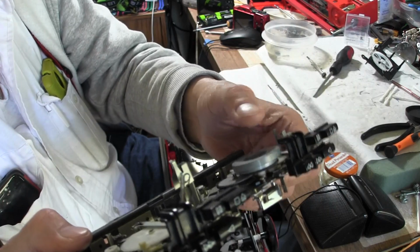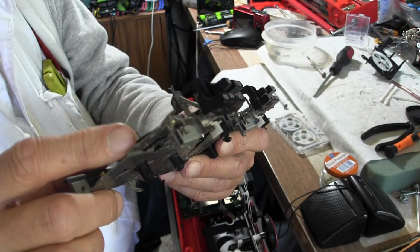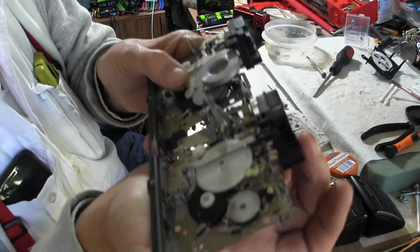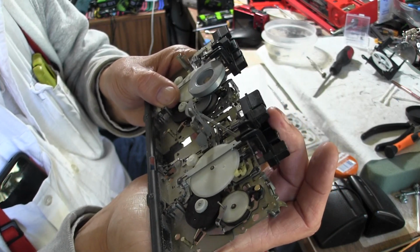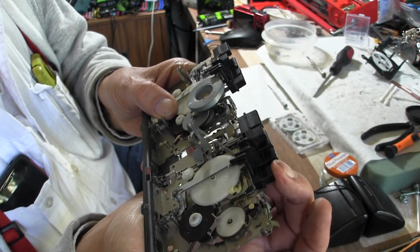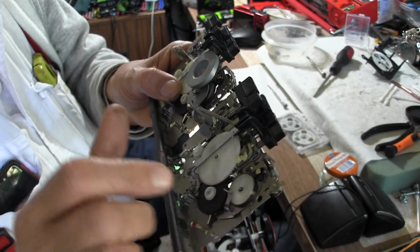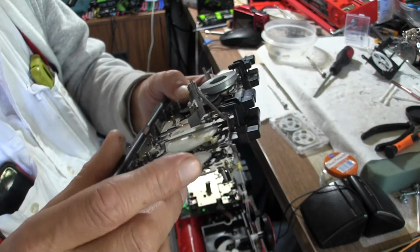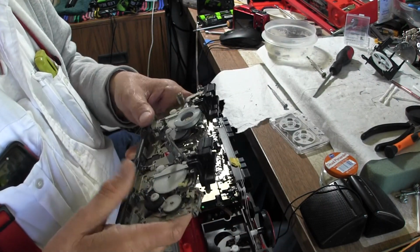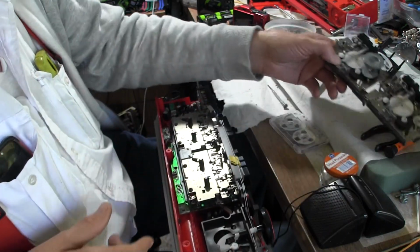You can replace the singular belt, which goes between the flywheel and the motor, but this is the worn out idler tire that functions everything. So when you hit that one, it engages that gear, and when you hit this one, it engages that gear. That's how it operates. It goes through this great big gear and goes across, but this has to be running, which is driven off of the flywheel. Anyway, something has to give, and this is what has given, and that's given, and that's all I'm trying to show you here.